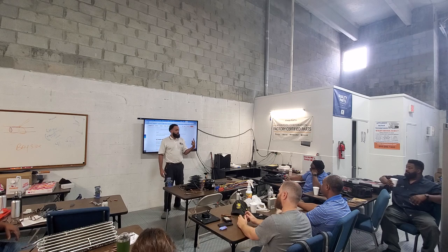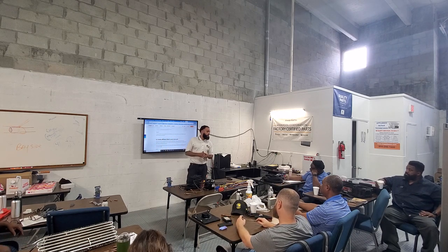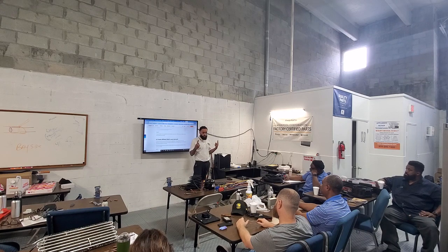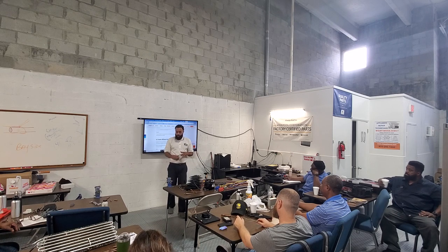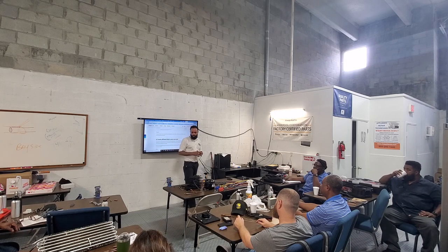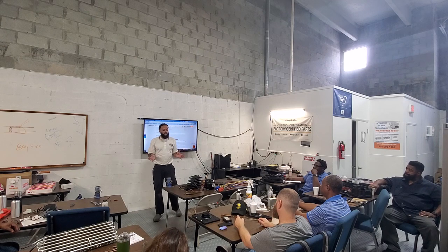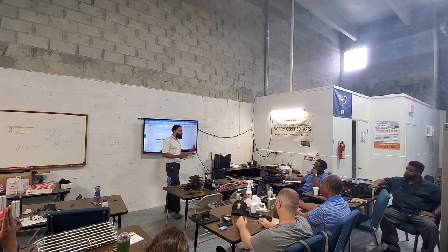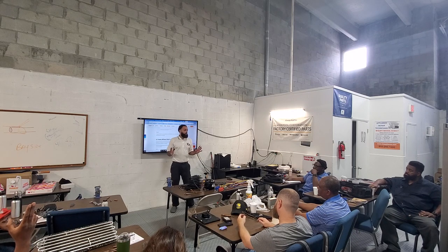The first one is, you tap in, and you get a PSI reading with the compressor running of 50 PSI. Is that a good compressor? Yes or no? It's supposed to be 60. I didn't say all that. I just said, is it a good compressor? Does anybody think that it's a good compressor?